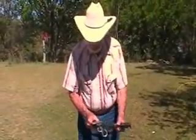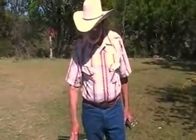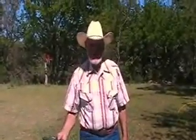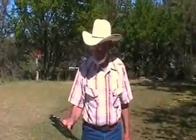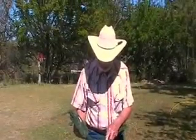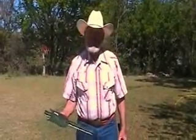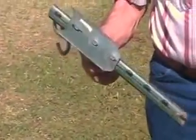If you're going to be pretty much in a permanent place, the thing about the round stakes is if it gets wet and dry repeatedly, or if you have sand or any number of things — the whole strength of the Portaflex is in the stakes. So we make a stake that really gets a good hold of the dirt. They're a little harder to drive and a little harder to pull out because of the knobs on them and the flange. But if your coil is going to be set up on a permanent or semi-permanent basis, I recommend these pins.